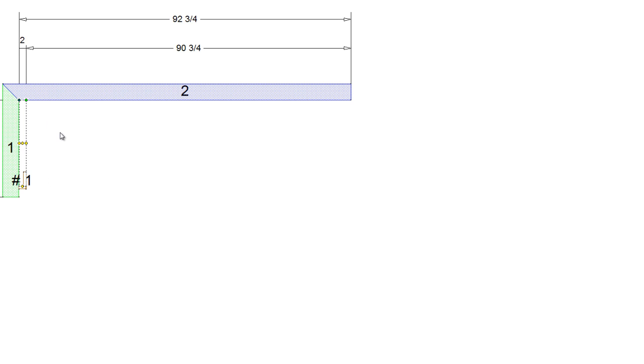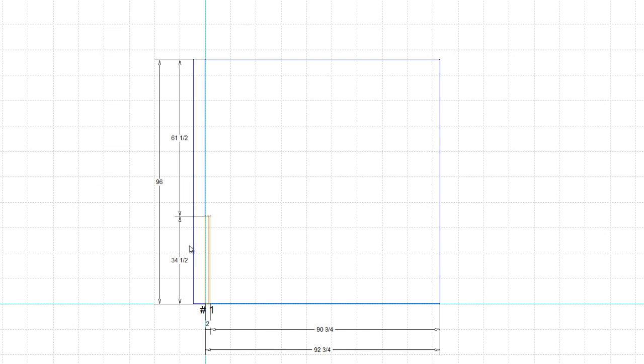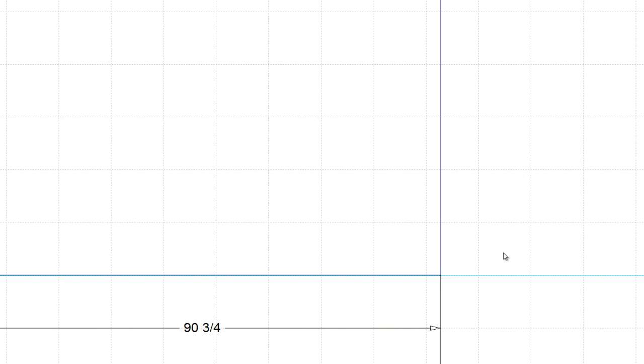Now, if we look at this, this is from top view. This is a base filler. And you can make your base cabinets in your library standard height, which is 34.5. You can also drop those down a little bit if you want taller bookcases, but typically 34.5 is going to be our standard, so we're just going to stay with that.